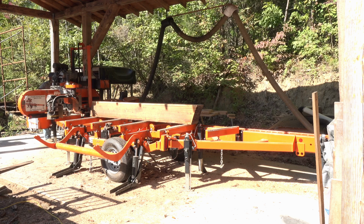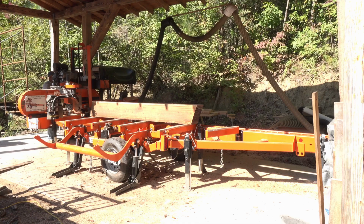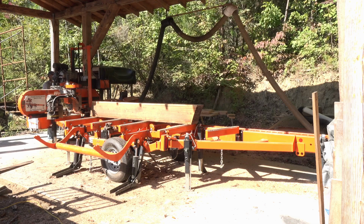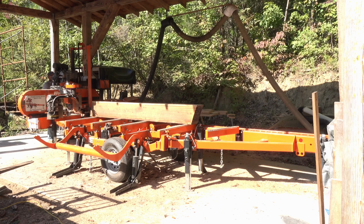What's the one below it or the one above it? Right now, below it. All your wood you're cutting, all the ones on top are above it. Right. The last boards is 1 inch below. And then the one above it gonna be thin. No, this one here is going to be 7/8 of a board. It ain't going to be 4/4, because you need 1 1/8 to make a 4/4 board. Because of the 1/8" saw blade thickness. Yeah. Well, there's going to be a thin piece of wood in there, though. No. It's not on this one.